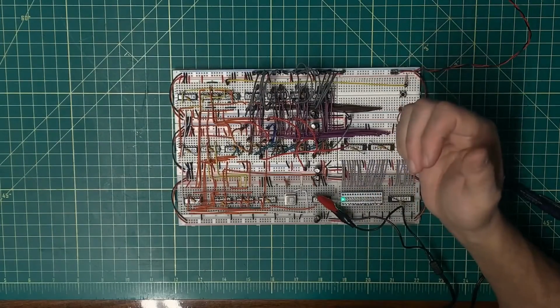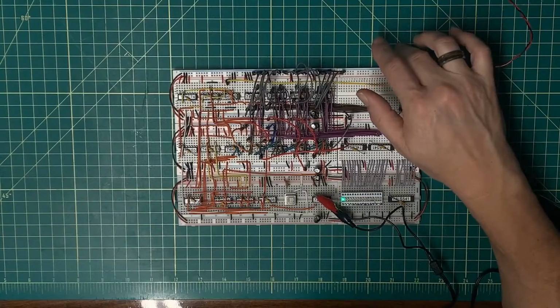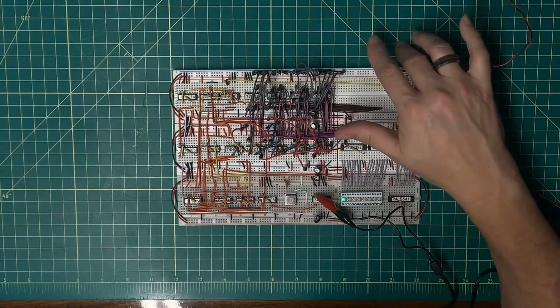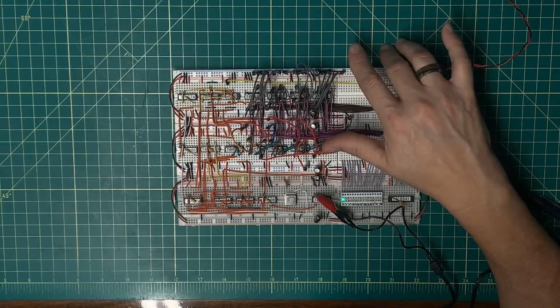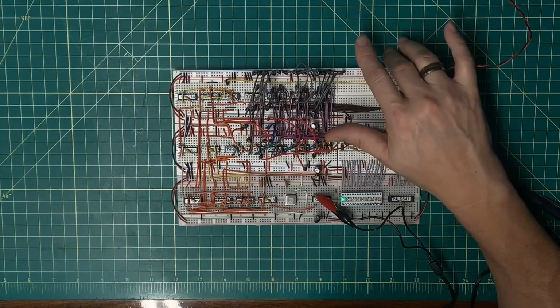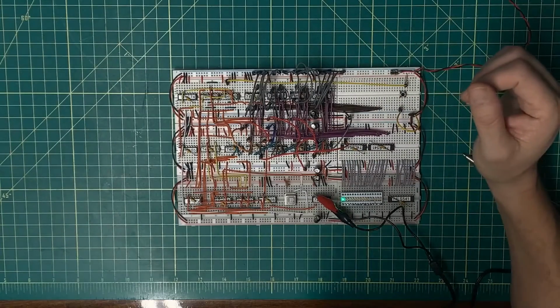Now, is this a problem? I don't know. And I won't know until I actually get an EEPROM and SRAM hooked up to this and actually go through the cycle, get myself a testing bus put in place where I can actually query the contents of the SRAM and make sure that last byte is actually being copied. I probably could go back to the emulator and create a purpose-built test file and use that in order to determine if things are copying. If that last byte was 0, it's entirely possible that it was not copied properly. But I did also fill it with FF and check it with that, and I think it actually worked, or at least I recall that it actually worked. So maybe I'm good, and I just need to get this settled.